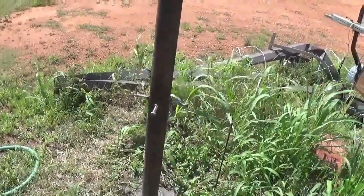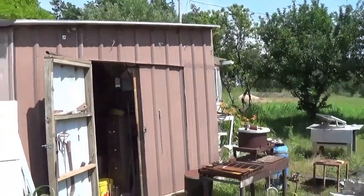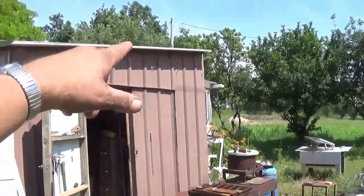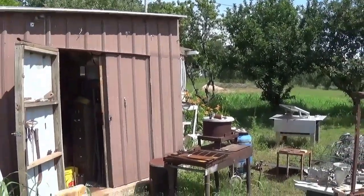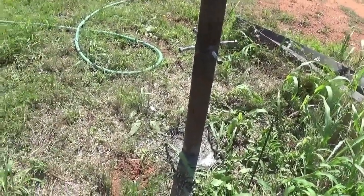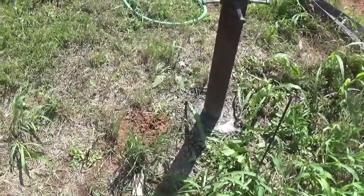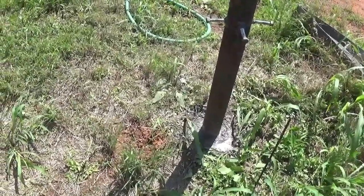I've been doing it this way because I wanted to mount some on the roof too, but the building doesn't really sit at the proper angle. What I may have to do up there is kind of make level platforms and offset it. It may hit the first ridge line and be down 6, 8, 10 inches on one end, then right at the peak on the other end. In order to get that angle, if I go 4 panels wide and they're 45.5 inches long, that's almost 16 feet — and at that angle over a 16-foot span, that could be 2 or 3 feet of difference.